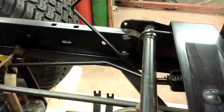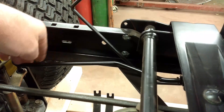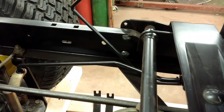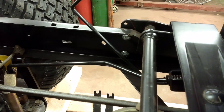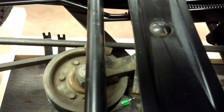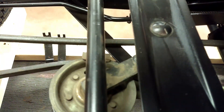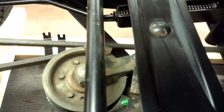Now that it's all together, you can see when you push the clutch pedal in, the first thing that moves is this rod here, which is what bypasses the hydraulic pump for the hydro drive. Now when you push the clutch all the way down, this is what loosens the drive belt and also pulls that cam forward to put the transmission back into neutral.